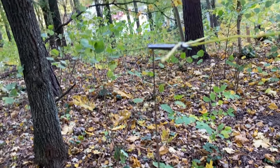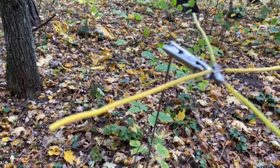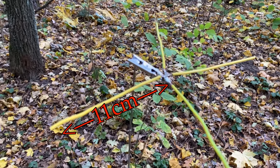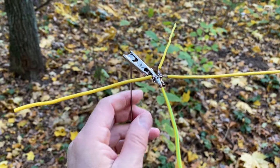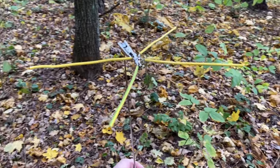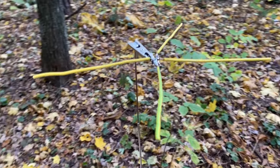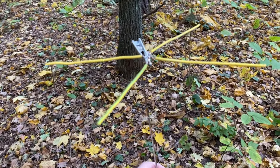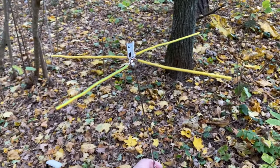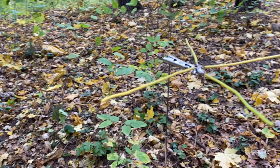The wires are arranged at the ends and I made a small black wooden coin as the center connector piece. You can also add additional wires, which will bring additional capacitance for the hat. Then you have to experiment with your resonant frequency movement. In this way we can have a cheap, quick, and extremely effective modification for the AX1 antenna improvement.